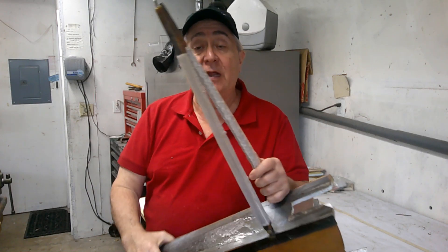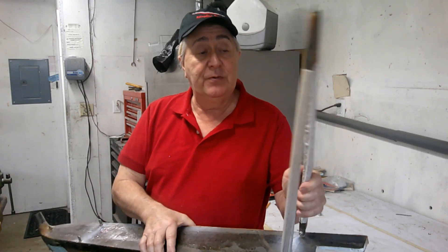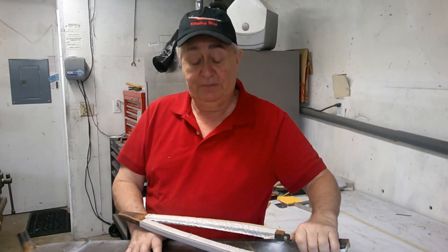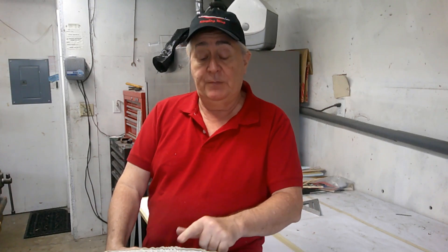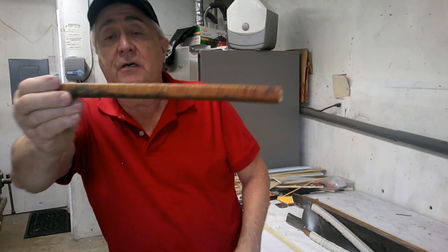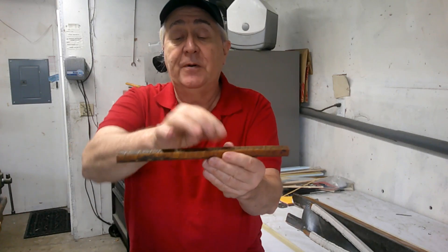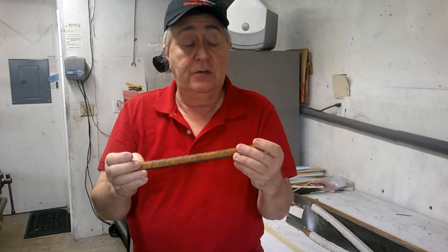I eventually achieved the right answer, and this thing has been hither and yon, crashed into Torrey Pines and all that, and this rib is still in great shape. The attachment bolt on the D-tube came a little loose on one side, but it was a crash. The rib itself has a multi-material core with carbon fiber cap strips, top and bottom, unidirectional, then wrapped in fiberglass — all done wet, so a massively messy job.